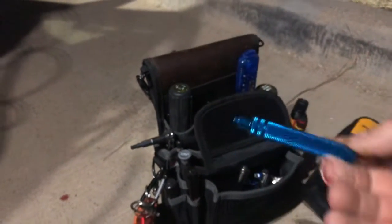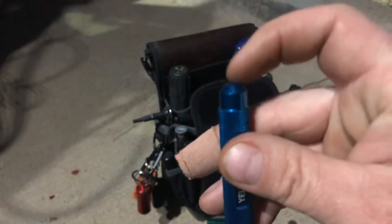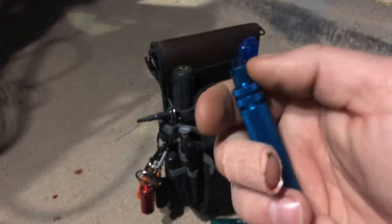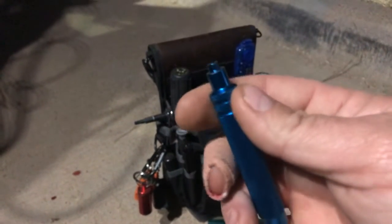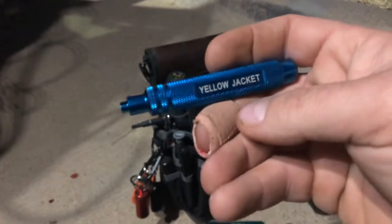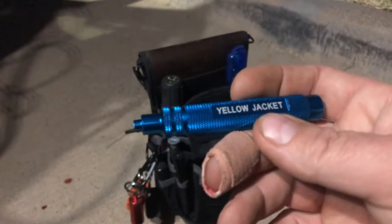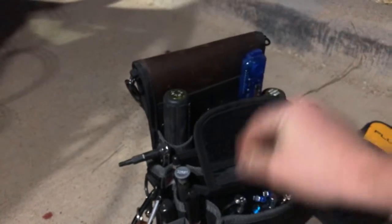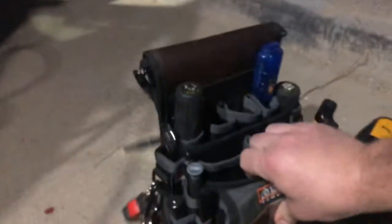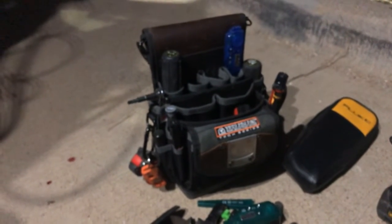This is a Yellow Jacket hose maintenance tool — it's got a little hook for pulling gaskets out of your hoses and a small stamper that fits perfectly inside quarter-inch manifold hoses. It even carries a couple of O-rings and other items so if you have a leaking hose it's a quick patch repair kit. That goes with me pretty much everywhere. Thanks for watching — hit that like button if this helped you, comment, subscribe, and let us know how we can help. Ask questions and we'll get back to you.